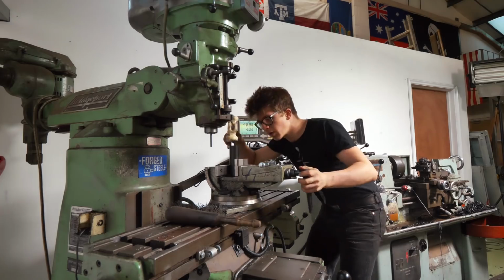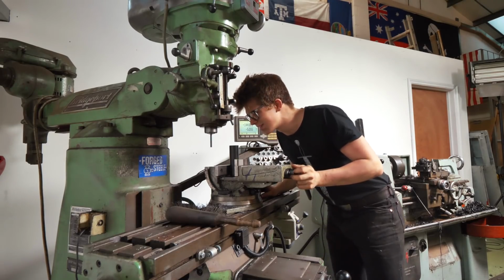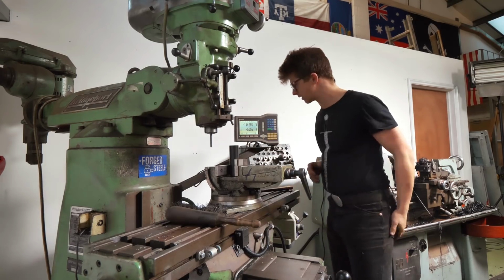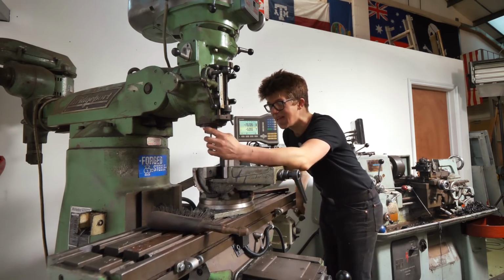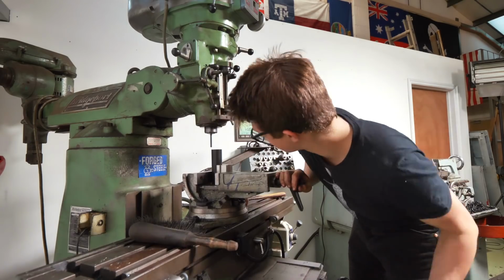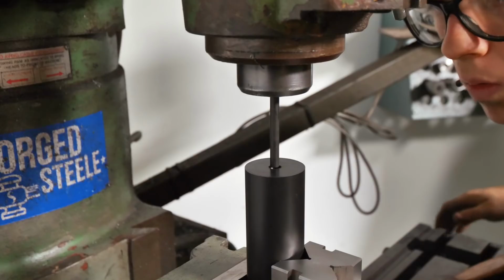That's not quite flat on the bottom. I think a few more hammer blows. Flat across the bottom, flat on the sides. We're ready to try and line this thing up. I have no idea how I would properly line this up. I've got a hole, and I need to find the center of the hole. What I have, however, is a piece of 6mm, perfect 6mm rod there, held in a collet. I'm going to lower this down, and we're gonna see if I can just inch my way in so it goes up and down and into the hole as smoothly as possible. By feel.